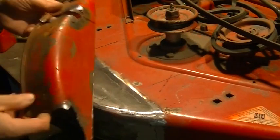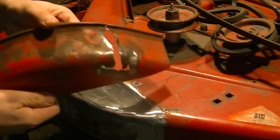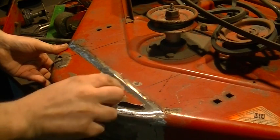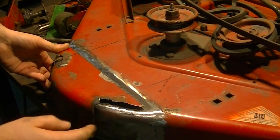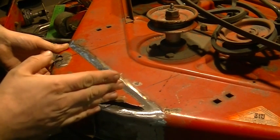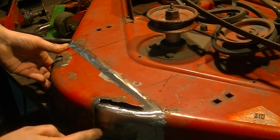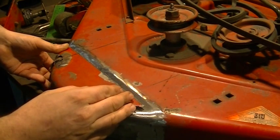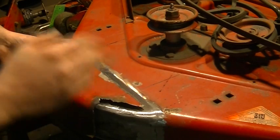What I'm going to do is cut along this line right here just to get rid of that dead section of metal. I'm going to line it up with the two lines that are on the frame and I want to see the contour of the nose that I created versus what was there, because I need to make sure that the brackets line up and get the correct position on the nose again. If those don't line up this whole thing is basically just an exercise in futility because it's never going to mount to the machine again.